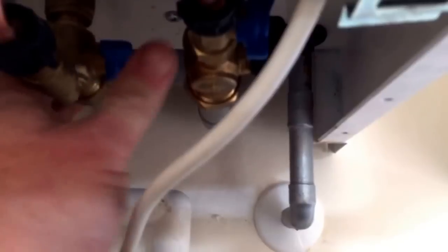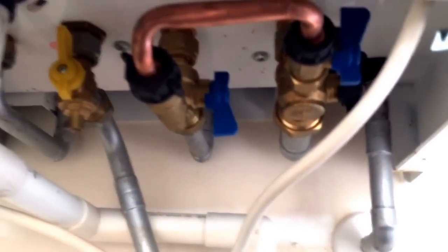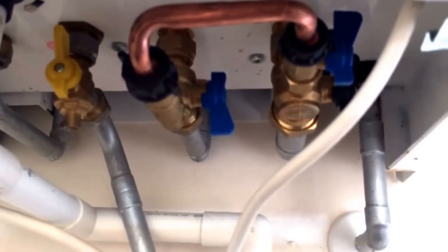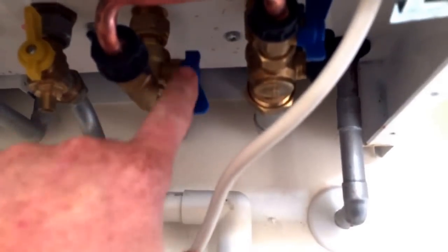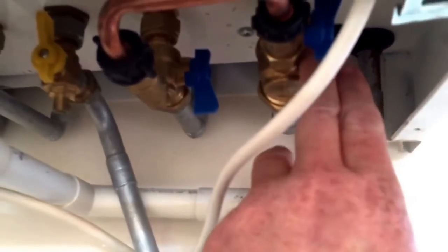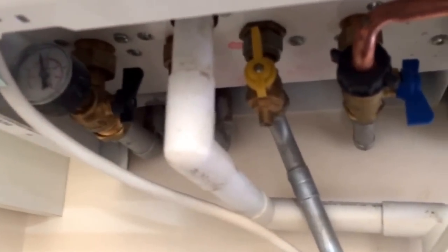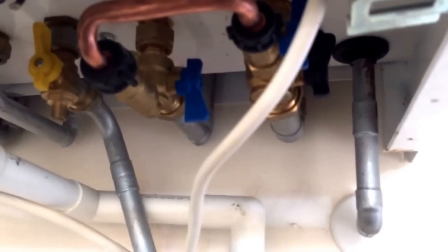Once you've got up to the desired pressure, turn both taps back into the original position — one pointing upwards and the other one pointing downwards. If for any reason you haven't got them back in the right position, you'll find that no water physically comes out of the hot tap. Just come back to the boiler and make sure they're in the right position. Please don't touch any of the other taps, or you'll end up isolating the gas or isolating the flow around the system, which means the boiler will come on and overheat. They all just need to be pointing vertically and then we shouldn't have any problems when we demand the heating or the hot water.